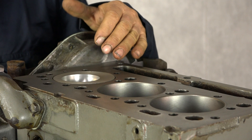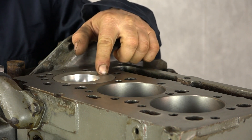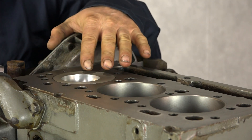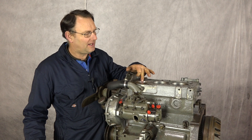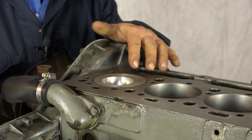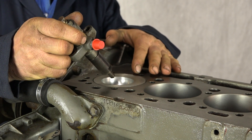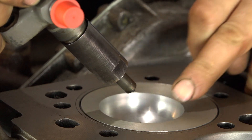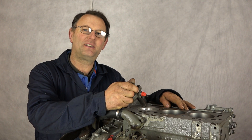If we take a look at the insides of the engine first, we can see that the most obvious difference is the piston design. On the indirect injection engines, the piston crowns are flat and there's no hole in them, and the combustion chamber is in the cylinder head. The combustion chambers on the direct injection version are built into the top of the pistons, as here, and there are varying different designs depending on the engine application and age. The combustion chamber is arranged so that the injector fires directly into the bowl on top of the piston. The injector nozzle features four very small jets which fire out around so that the fuel goes into all parts of the bowl. And we can see from this that this is where we get the phrase direct injection from.